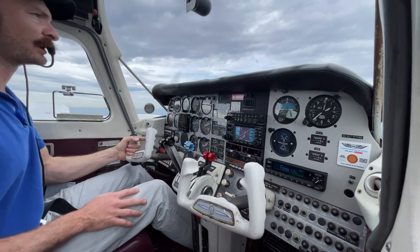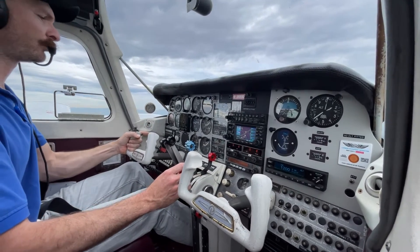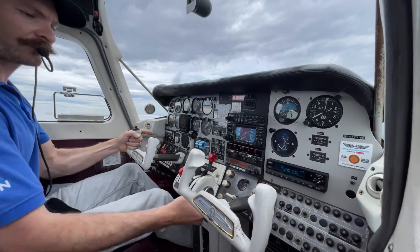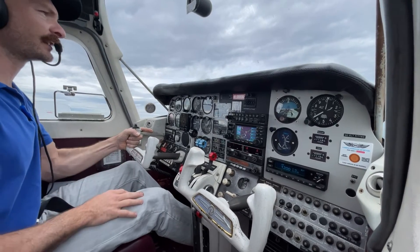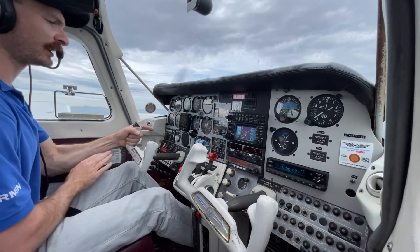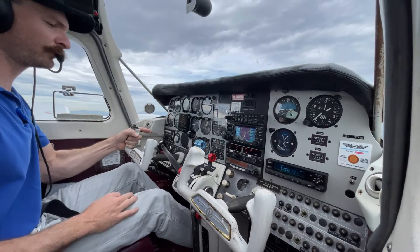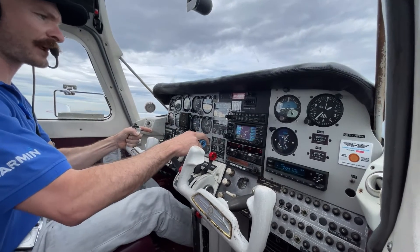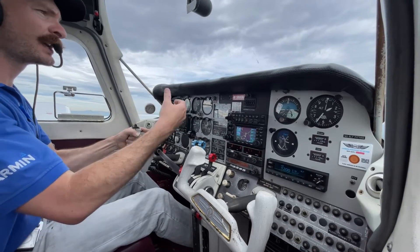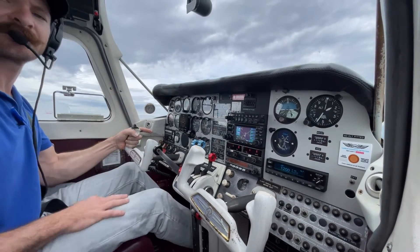Let's look at a simulated left engine failure — I'm going to pull the mixture to idle so the engine cuts off. Maintaining directional control, wings level, ball centred initially. Confirm mix up, pitch up, power up, gear is up, flap is up. The airplane is now flying — not flying well, but flying. That's what I mean about slow and smooth. Confirm dead leg, dead engine — the dead leg is the left, dead engine is the left. Confirm it with the throttle — no yaw change, so we know that's the correct engine. Flag it back so it's obvious which one it is, and we would then feather. I'm not actually going to feather because I'm going to start it back up. Even without it feathered it's just maintaining flight — if we feathered the prop we'd get a lot better performance. Being light at the moment is why it's performing fairly well unfeathered. The main thing is being accurate on these drills and not missing anything.